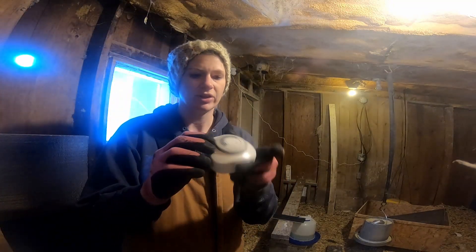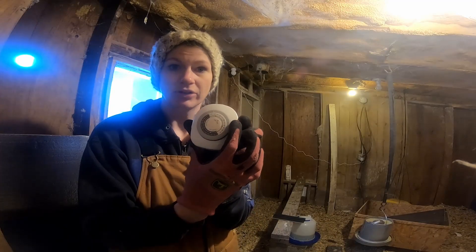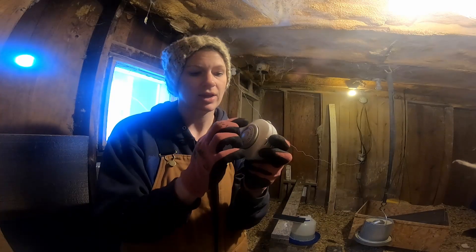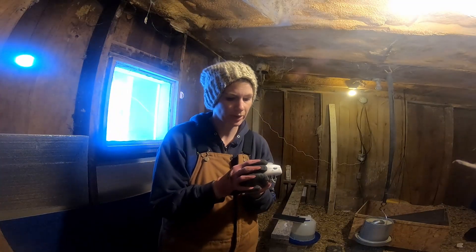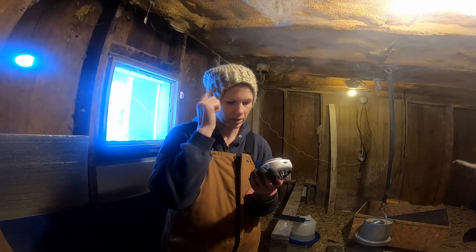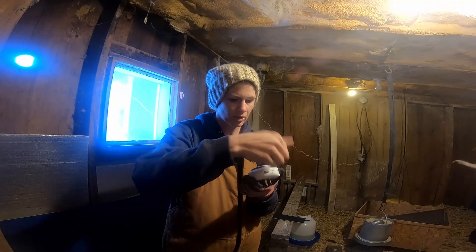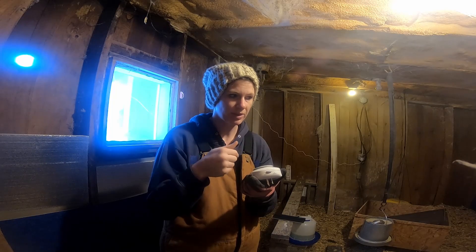This is why I was confused — it says AM under one 12 and PM under the other 12. I thought the whole dark-shaded area was AM and the rest was PM, but it just means this is 12 AM and this is 12 PM. So you put it on whatever time it is now — about 1 o'clock — then you push up the pins for whatever time you want the lights to go on. I want the lights to go on at 6 AM and cut off at 8.